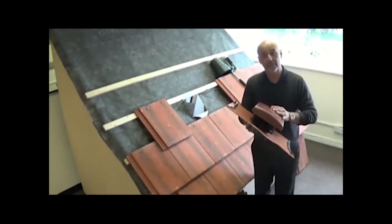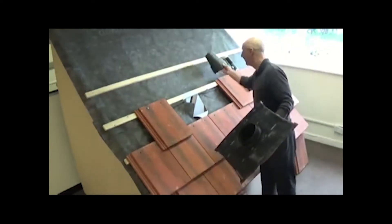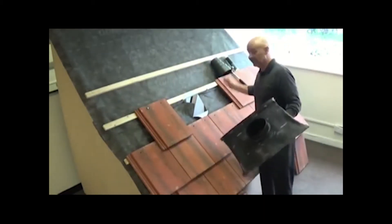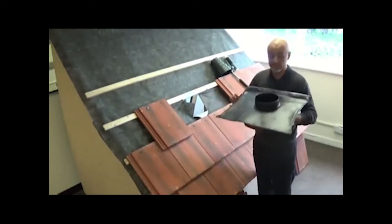If we're going to use this as a terminal — the UB-41 — then we need to introduce the stepped adapter. This is solvent welded onto the spigot and trimmed off to the size needed to fit the ducting. Today we're using this as a UB-16 tile vent, so the 160mm spigot will go into the size of the felt that we've cut.